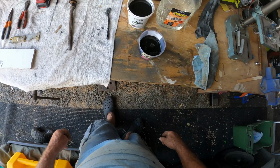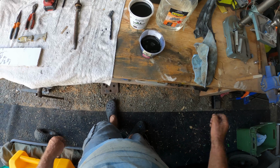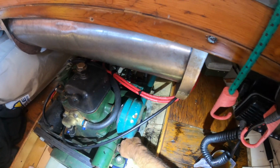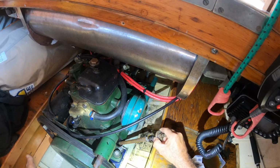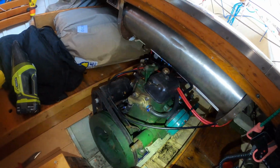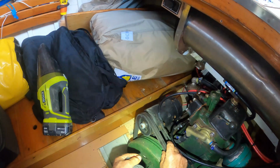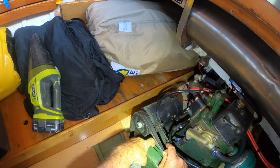Looks like it takes about 1.5 litres, maybe 1.75, so it's time to go to the workshop manual and find out. 1.5 litres of good old-fashioned mineral diesel oil to clean up all of this black gunk, which is rubber off the belts. You see the belts have gone pretty slack, notch belts, and I'm not even sure if they're the right profile.